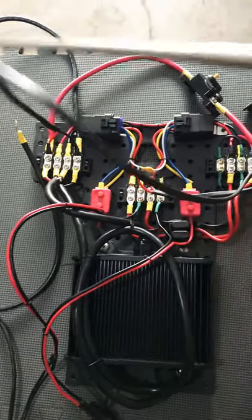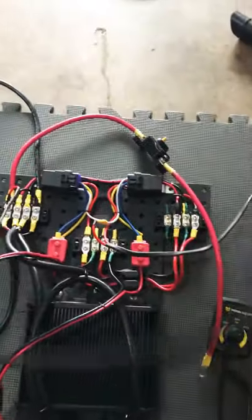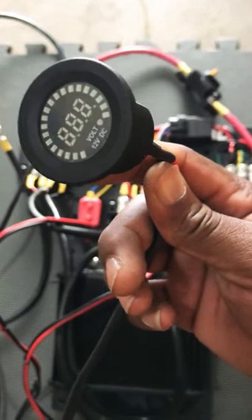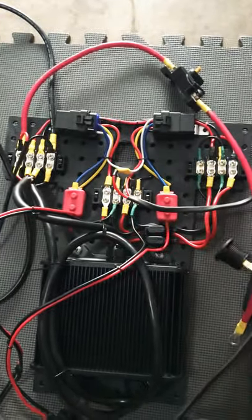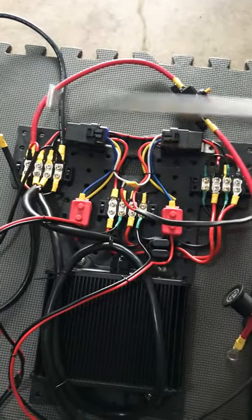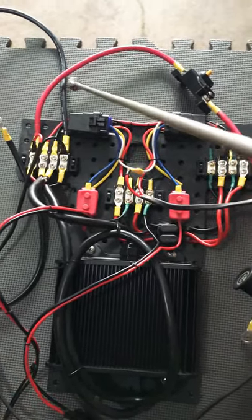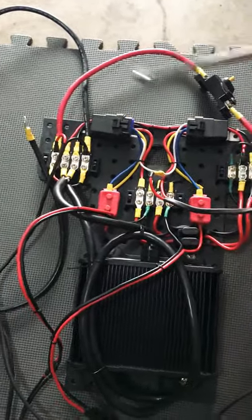This cable is attached to this monitor here. This little thing tells me how many volts I'm running — whether I'm high, whether I'm low — as I'm using my trolling motors. I use this bus bar to basically send the same signal elsewhere. So basically you've got the negative here and the positive here, sending it to this voltmeter.